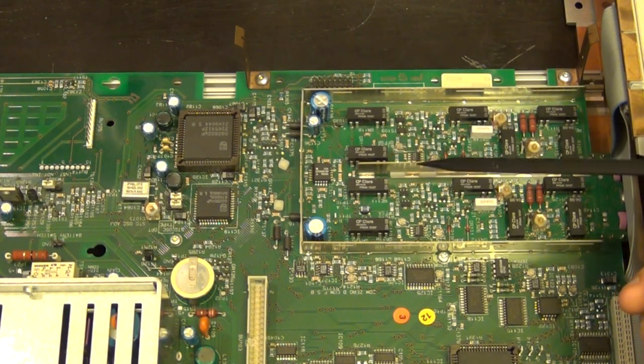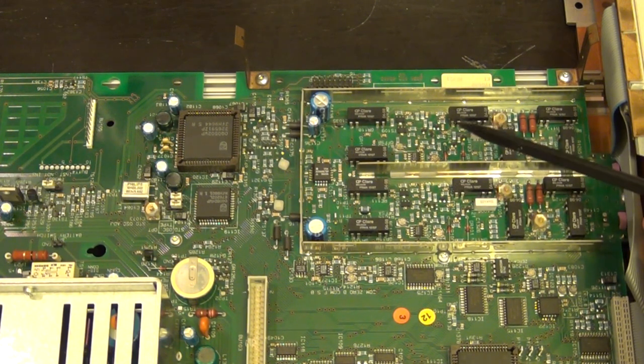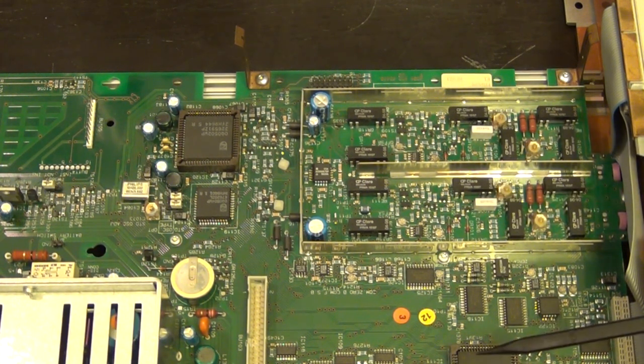Now, if you watch my other repair video where I repaired an HP 5347A, which is a 20 gigahertz counter, the principle of operation of that one is completely different. That one depends on a step recovery diode, and it creates a comb of frequencies, and it mixes them, and it picks one, and then the IF generator analyzes that. So there's a lot of information available already on my channel about this type of instruments, and I recommend that you take a look at it.